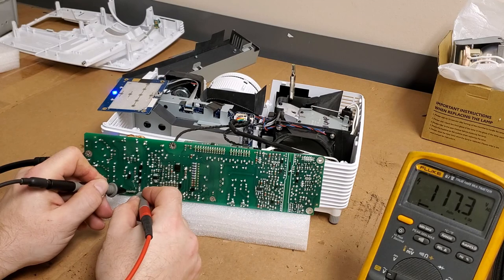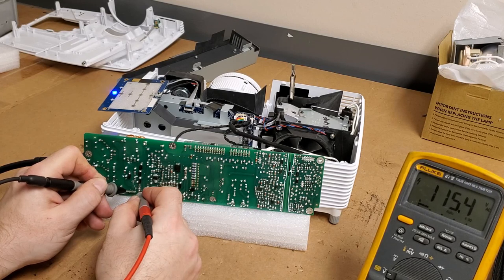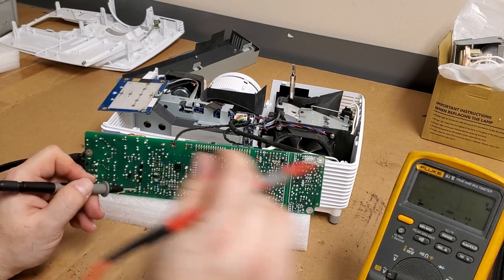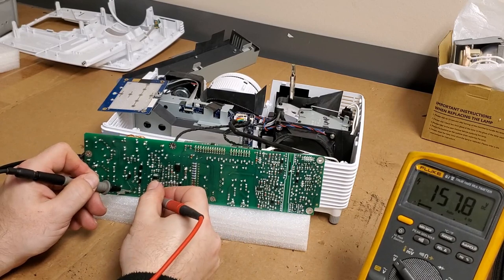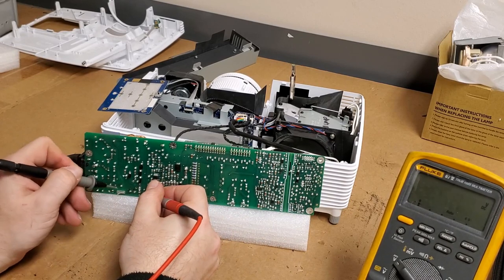I have a theory about that relay, but let's see if the AC voltage changes at all when it tries to fire. And if it doesn't, then I know it's on the DC side. Just a tiny bit, almost negligible. Yeah. But we're getting 120 there.